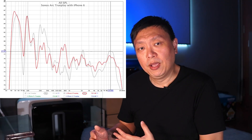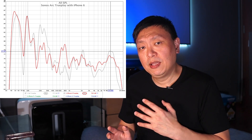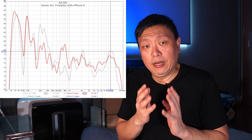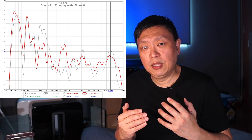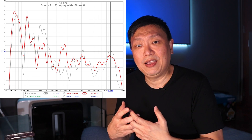For ease of reference, I will break up the analysis into four sections: bass below 100Hz, human voice between 100 and 300Hz, mid-range between 300Hz and 3kHz, and treble above 3kHz. The curve for TruePlay performed with an iPhone 6 shows that the bass peak has shifted to the left, giving the Arc a better bass response with higher volume at around 46Hz. It has also pulled up the 80Hz dip quite significantly. In the human voice range, it has pulled down the peak between 200 and 300Hz, which straddles the male and female voice spectrum. In the mid-range, it has strangely peaked the 550Hz to 900Hz range, making the speaker sound more in-your-face.